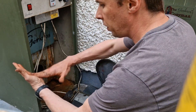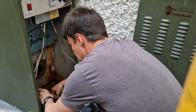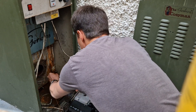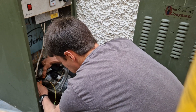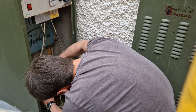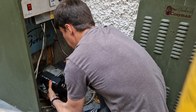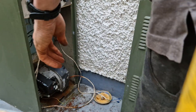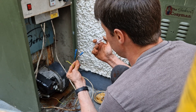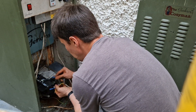The furnace is back together. I've obtained a fake tan on my palms, which is useful in Ireland. Now let's see if it runs — I think it should. Connecting the fuel line back in there. Okay, let's put the wiring back in. But before I do that, just going to double check to make sure nobody turned it back on — nothing's live here. Brown is the most important one — we're all good.